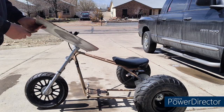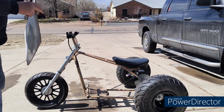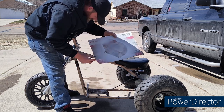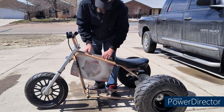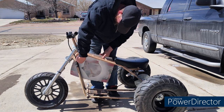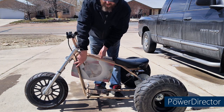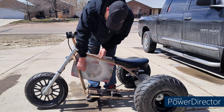So all I'm going to do is take a piece of cardboard and a magic marker — this one I found happens to be gold — and I'm just going to trace this shape onto the cardboard. I'll lay it on the outside and trace the shape of the inside here. I want these gussets to go a certain length down the down tube because this frame has been repaired.